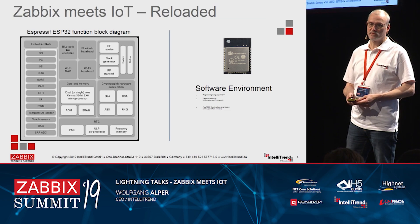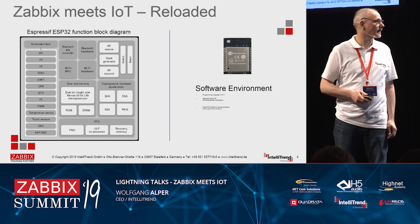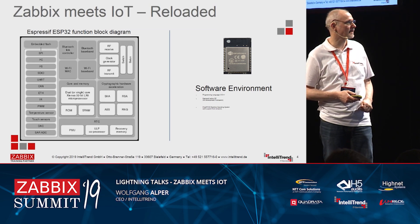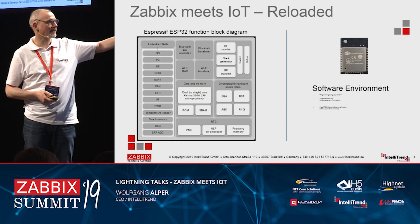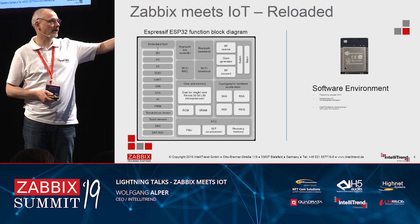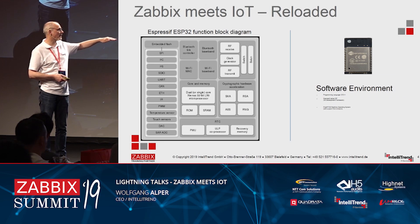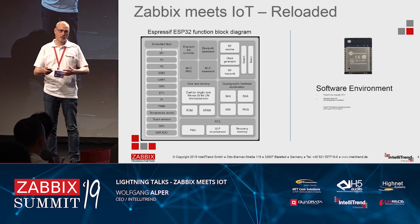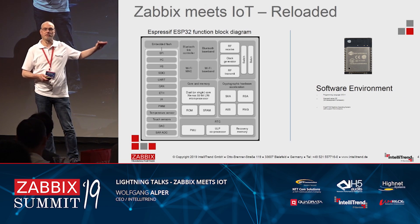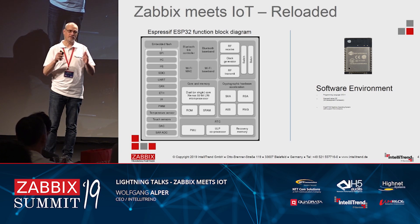This device is based on the ESP32, a well-known IoT chip from the company Espressif. You have to use the programming language C or C++. You use the native IDF — the IoT Development Framework from Espressif. On top of this, we run FreeRTOS, the free real-time operating system, which is also used and sponsored by Amazon for their own IoT device series. This is the software and hardware foundation of what we use, and there is a lot of material available online.